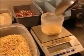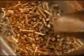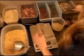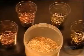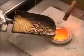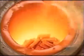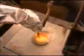Bright yellow, so it's common to create an alloy to strengthen it and alter its color. Copper lends a reddish hue, and brass helps the alloy melt more quickly than gold and copper would alone. Depending on the ratio, adding these metals produces 14 or 18 karat gold. They melt the mix in a crucible at 1010 degrees Celsius. Just 3 of these scoops are enough to make about 5,000 14 karat gold chains.